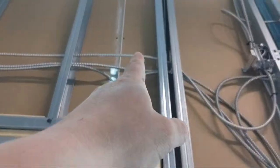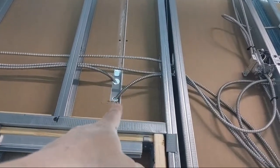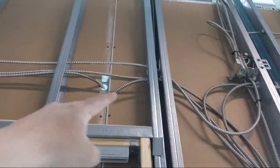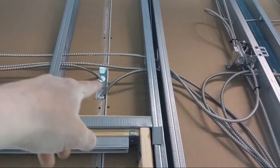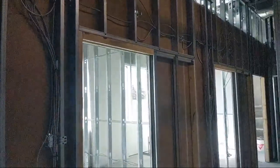So now when you have this sheet halfway on the stud or to the wire, it's easy for the sheet that you're butting in on this side. Just go bottom up, and I don't measure out ever. I always go 1.25 inches. I just come out 1.25 inches for that. But I measure up and down, like the ups. That's it, boys.